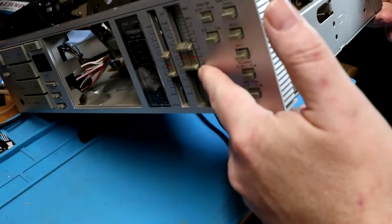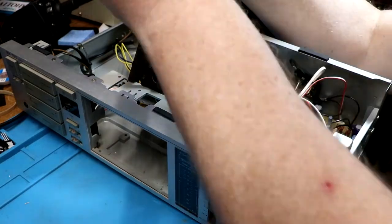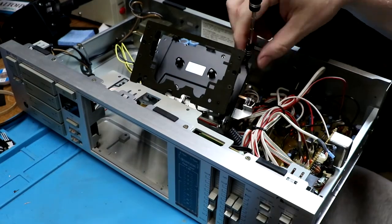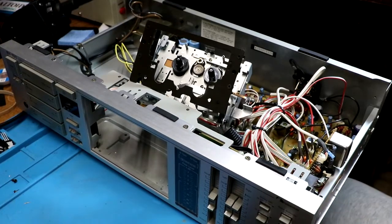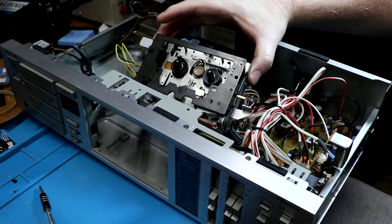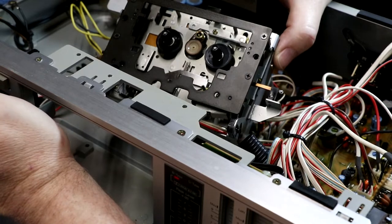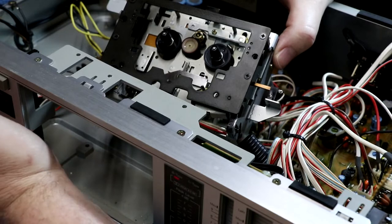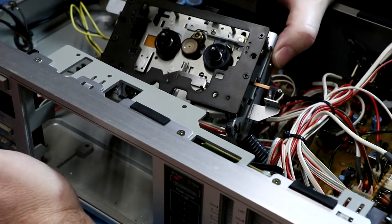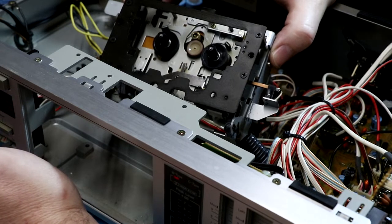Of course the screwdriver's underneath — that's just the way things go, that's life down here at the Rattle Bunnies Den. Let's see what it's doing now — get a little bit of power on this puppy. You can see that delay there, shows that the tire is getting tired again. It is moving, just not moving well, and it stops because when it goes the other way there's no tape in it, so the counter doesn't go up and it automatically stops. If we hit play it still does okay, but you can hear a slip now, so it definitely needs to be replaced.